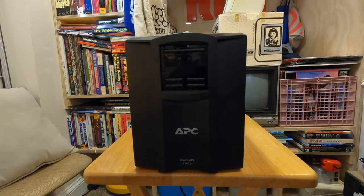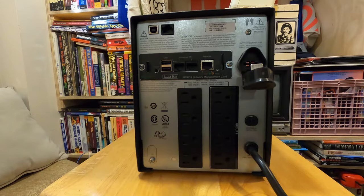I'll do that in a second but first let me show you the back of this thing. Before I go into what we're actually looking at, you're probably asking why I bought a $120 used UPS that needs new batteries instead of a brand new UPS for about the same price with working batteries. That really comes down to the fact that there are several different lines of UPS. Specifically for APC, their Smart UPS line is a lot more expensive than something like their Back UPS line. This unit brand new is probably around $600–$700, whereas the Back UPS is around $100–$200 depending on the model.